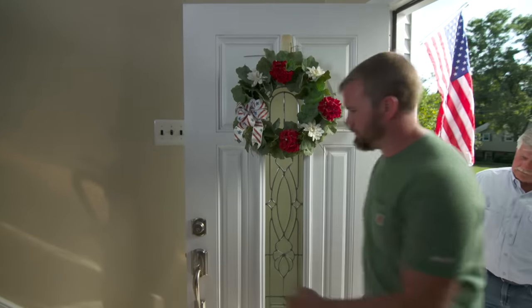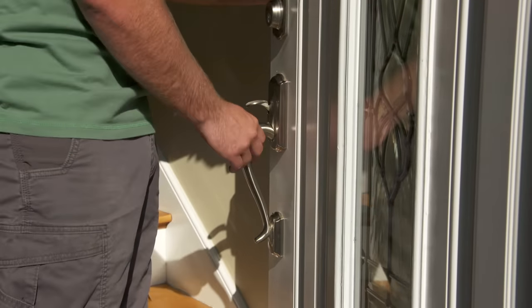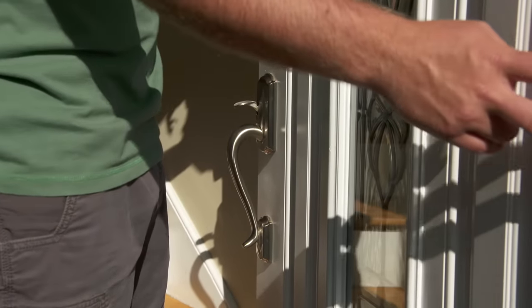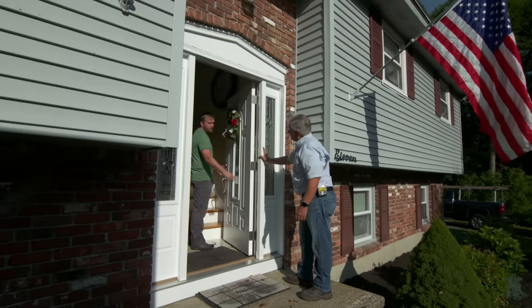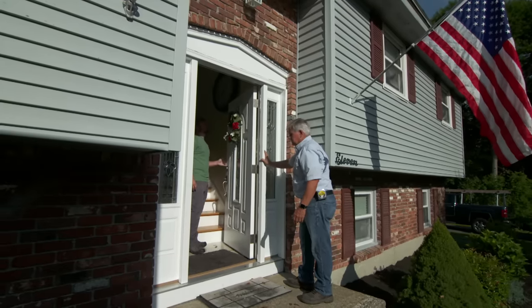Well, what do you think? Take a look. It looks like a nice light fiberglass door — same on both sides. We could flip the hinges, flip the hardware right around. We don't have to cut new stuff in. That would be a big job if we had to do that. How about a bevel? No bevel on the edge. That's good, it's pretty square.